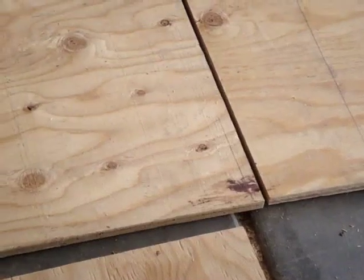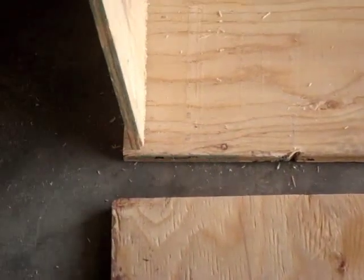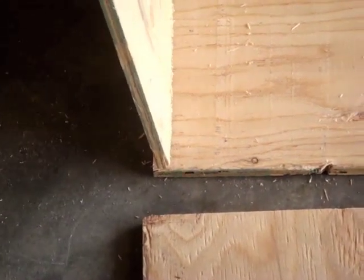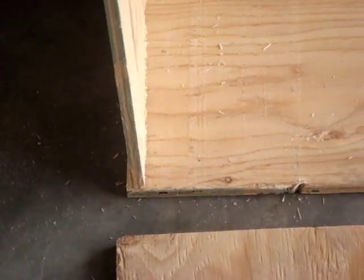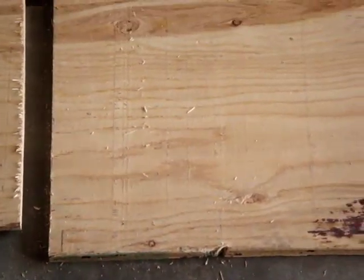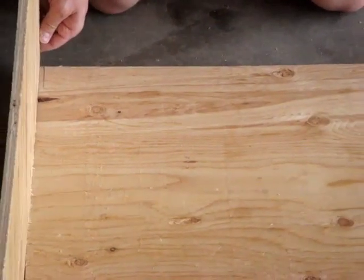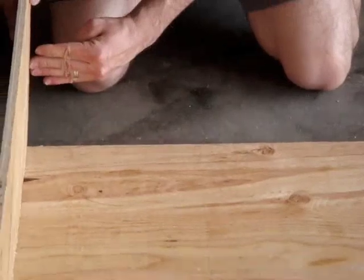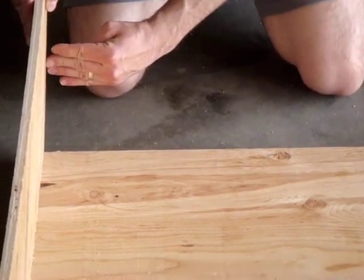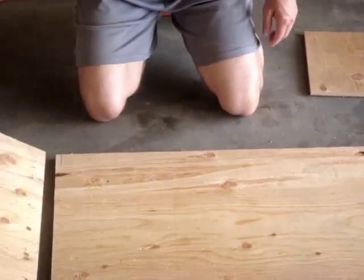Do the same on this side. It's basically half an inch on each side, but we just did this to be exact. Put a pencil mark on the inside here, so the length of this board is going to be from pencil mark to pencil mark, because that board is going to go right here on the inside of this board. So you've got to accommodate for the width of this board on this side and on that side.